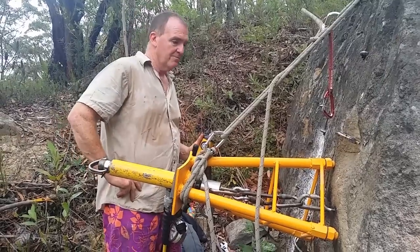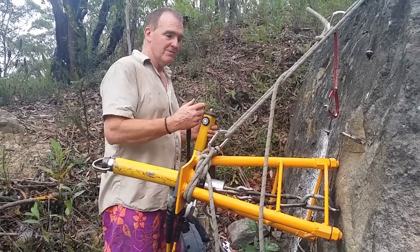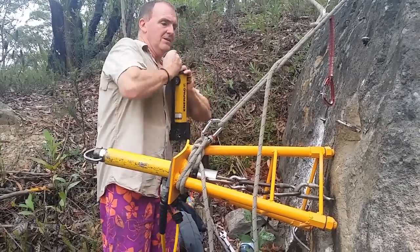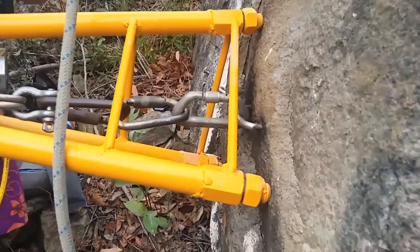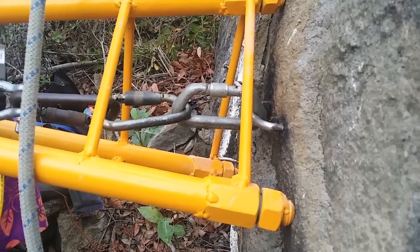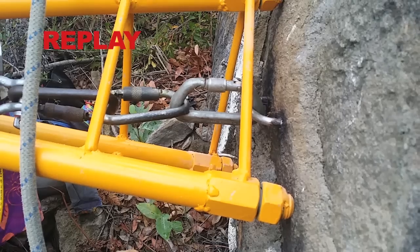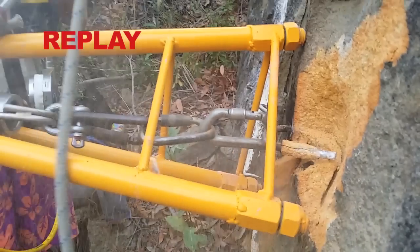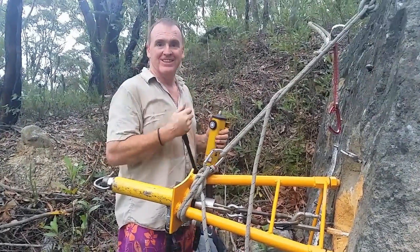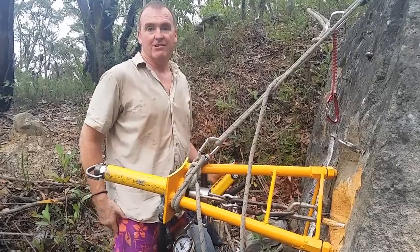Big old belay anchor made with Megapoxy — Bert and Neil burnt the hell out of it yesterday, so we're testing it. It's already up at about 16 kilonewtons because it hasn't started bending yet. It's once again bad rock. That broke out at a bit over 30 kilonewtons — I'll have to calculate it later.